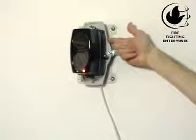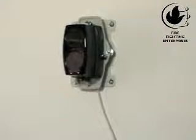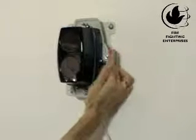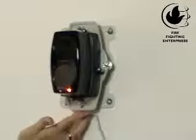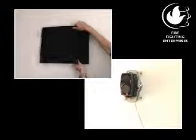With the beam powered and reflectors installed, move the mode switch to the up position, which is reflector targeting mode. In reflector targeting mode, you are trying to find the reflector by steering the beam detector with the vertical and horizontal thumb wheels. The faster the amber LED flashes, the stronger the signal back from the reflector. Steer the beam detector to get a solid amber LED. Once you have the solid amber LED, confirm you are actually on the reflector and not on another object by covering up the reflector and checking the amber LED goes out.